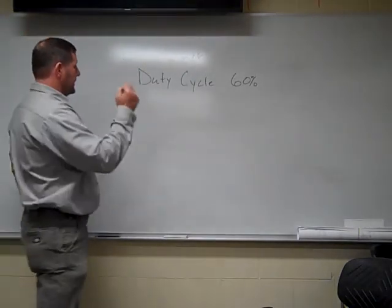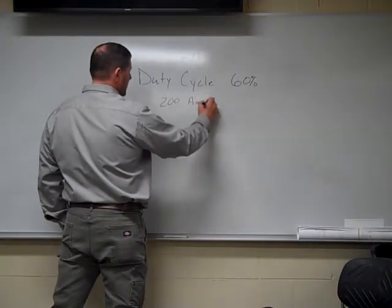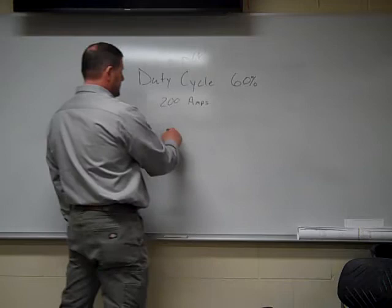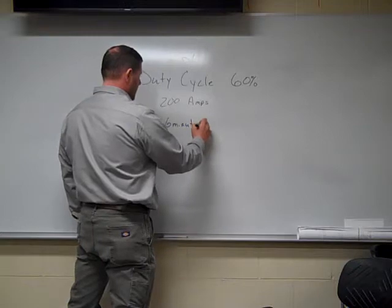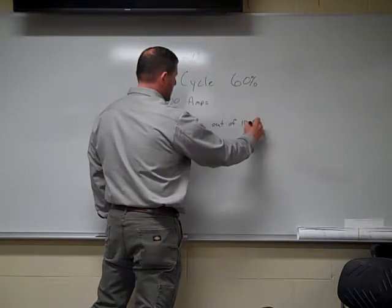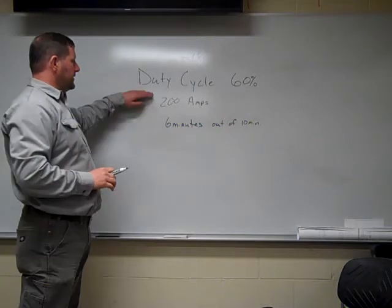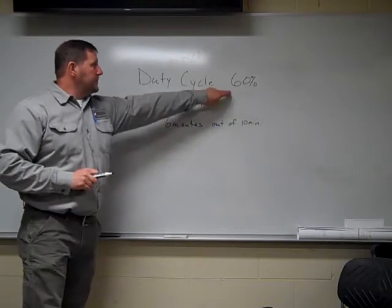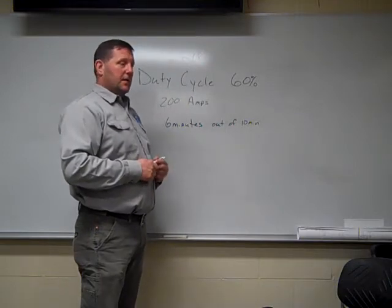For example, let's say we've got a Dynasty 200 out there. 200 amps is what that welder is rated for. So I can run at 200 amps for 6 minutes out of 10. That's 60%. Every welder is going to have a little bit different duty cycle. 100% duty cycle means I can run at 200 amps all the time. 60% means I can run, like I said, 60% of the time at that max rated output.